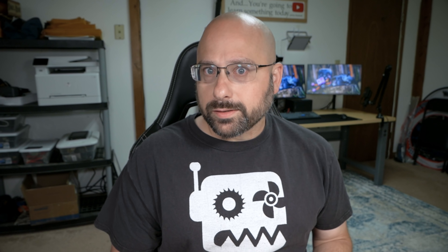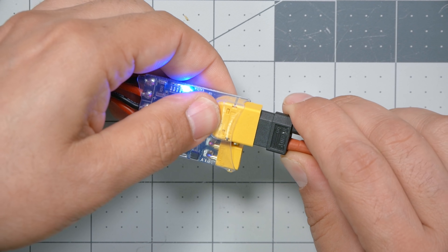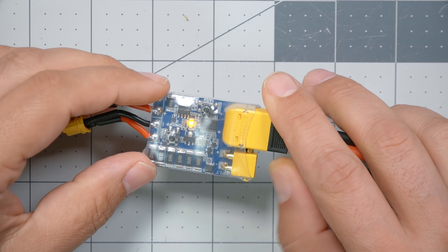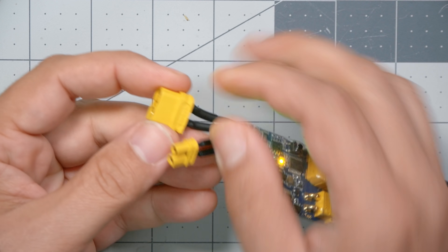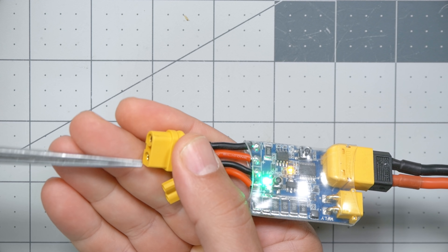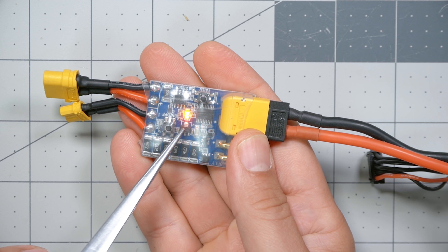Let's briefly recap how a smokestopper works. We've got a 4S lipo, and if I took these tweezers and stuck them in the prongs of this lipo, really bad stuff would happen — because when you short-circuit a lipo, lots of current and smoke and fire and sparks happen. So we're going to use this: the V-Fly Short Saver V2, basically a smokestopper with an on-off switch. If I take my tweezers and stick them in the output XT60, absolutely nothing bad happens, because the short saver detects the short circuit and cuts off the battery.